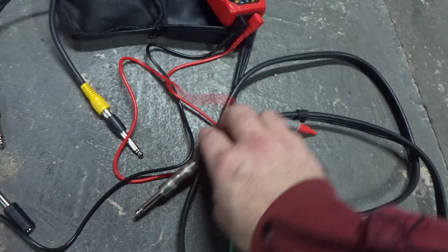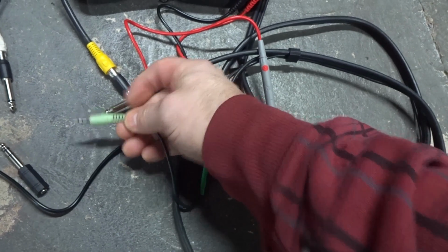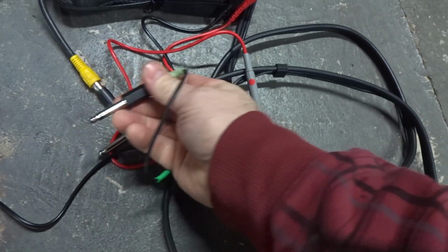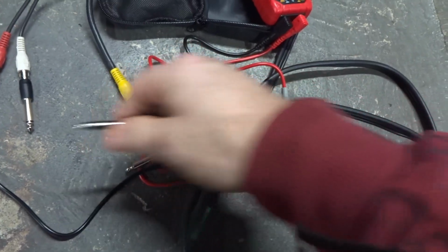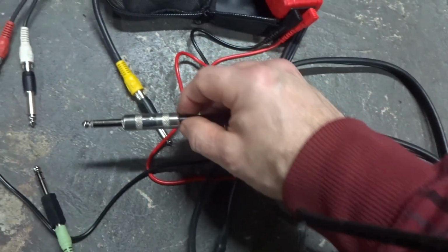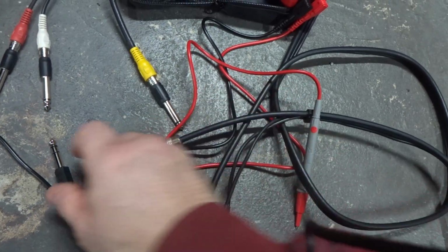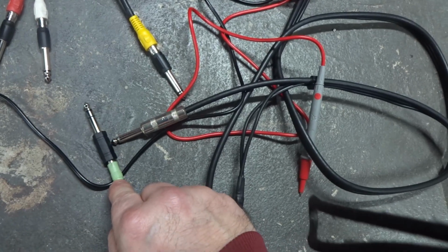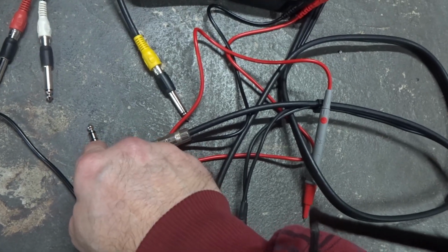The other thing I was thinking about doing was actually using another 1/8 inch TRS, connecting it in here, and the way, if you wanted to run it mono, you wouldn't have to pull it out. You would run like on this yellow one here, the way I did it here. It's just an instrument cable, really. So you would take the insulation and you would go to ground over here on the TS 1/8 inch, and then that would transfer over to here on the 1/4 inch adapter.